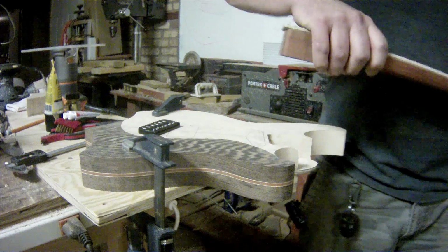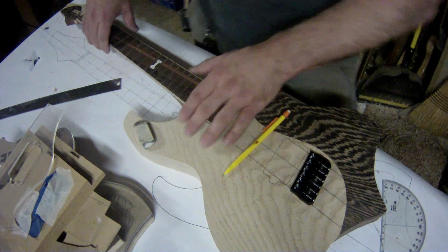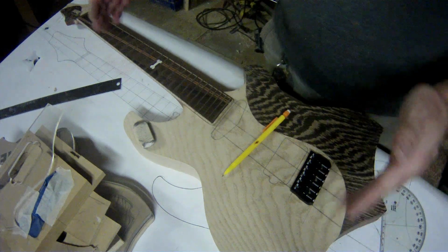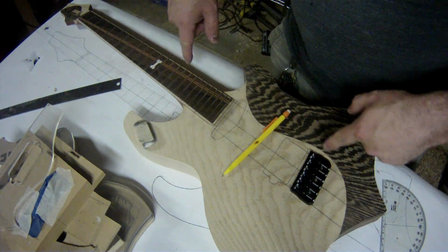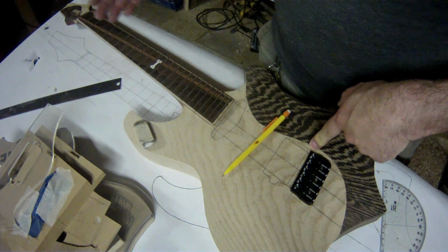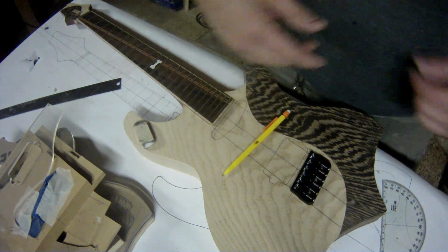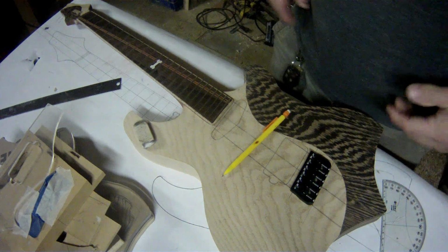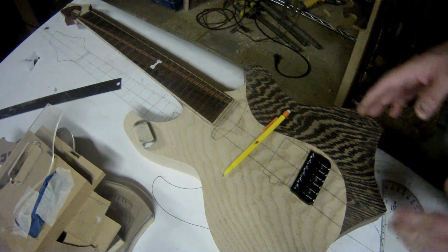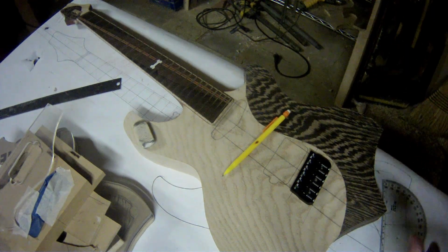I think we're just about there. I used Hipshot's website to decide which bridge I needed. With a 25.5 and a 24 3/4, with the 9th being our perpendicular fret, they suggested the 11 degree bridge. We actually need somewhere around 6 degrees, so the saddles are not going to wind up as offset looking in the bridge as they normally do.